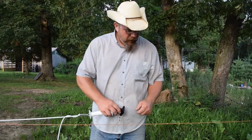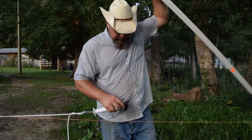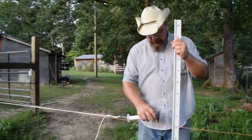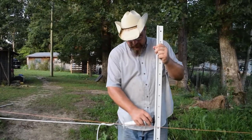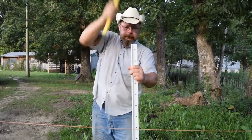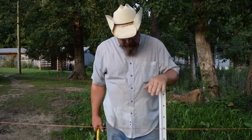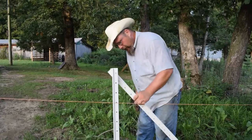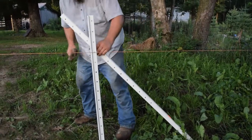What we're trying to do right now is get a measurement for our temporary gate. I'm going to get a post here and we're going to be using our inch-and-three-quarter end fence — it's probably going to be somewhere about right there. I really love this gate, it stretches. We're going to install an inch-and-three-quarter termination fence here, drop this down to about 42 inches, and I want to be in about the fourth hole at about 45 degrees, right on that line.